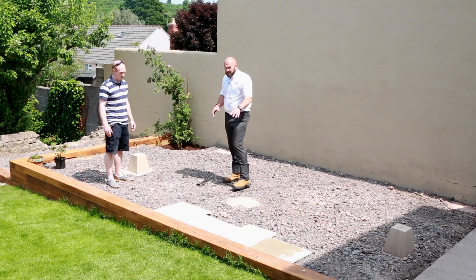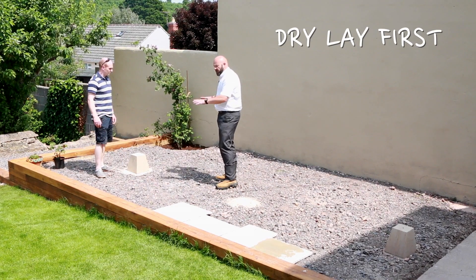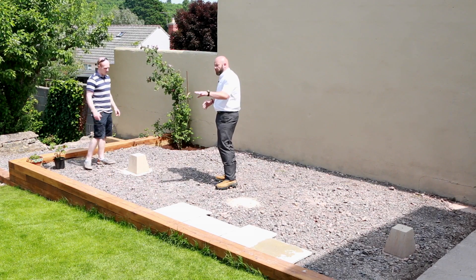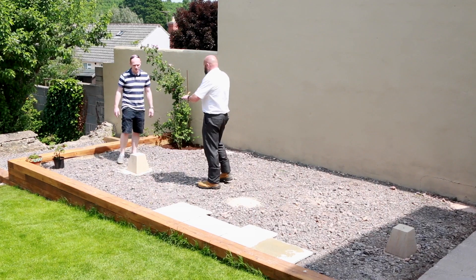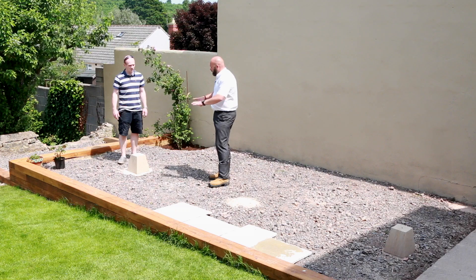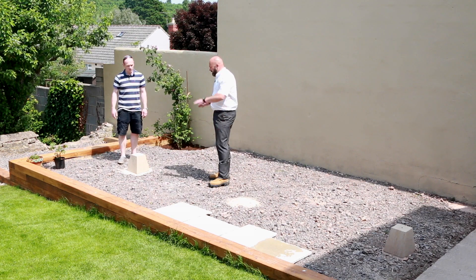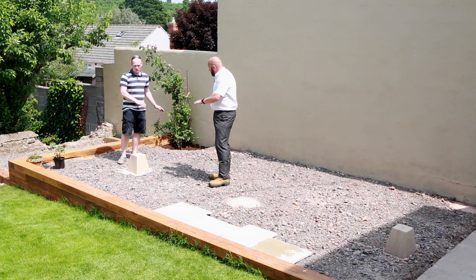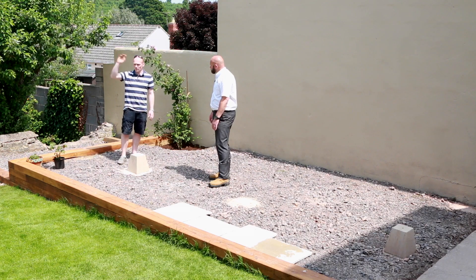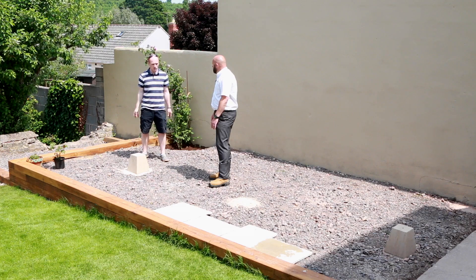The best lay plan is obviously to take mix from the packs and dry lay your area. It is a bit of a headache, but dry laying the product out to what you want means you'll know where your cuts are going to be, how much you're going to need, and you can measure it up more precisely. Once you've done that, move it to the side and bring one across at a time. Mix up all the mortar on the far side and barrel it over, so it stays clean and you're just working on a section at a time.